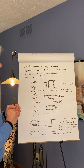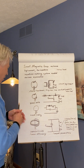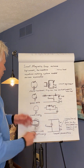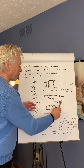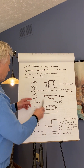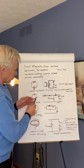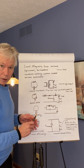That's one way to step up the impedance. We all know about L matching networks — you'll see some of that here. We know the gamma match, the most common match system used for antennas — Yagi antennas and many others. I've been fairly inclusive in this circuit equivalent: I have the gamma portion and the magnetic loop antenna portion. The gamma system has inductance here and here, and in parentheses a variable capacitor. Sometimes there isn't a direct shunt connection but a sleeve with a capacitance junction, and sometimes in gamma matches a variable capacitor is incorporated.